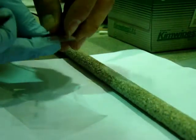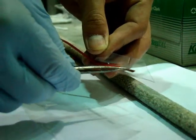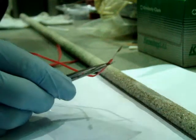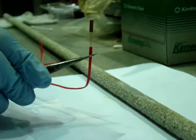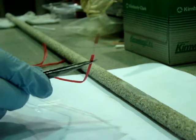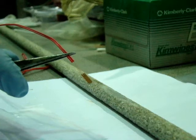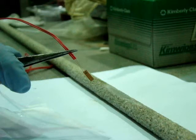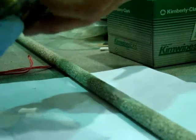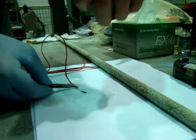At this point, remove the strain gauge out of the transparent envelope using tweezers — be very careful. One point to mention here is to make sure which side is the bonding surface. The side that has no wires or no metal things on it is the bonding surface. The other side with the rectangular triangle marking is the upper side. Put the strain gauge on a clean surface of metal or plastic film with the bonding side down.